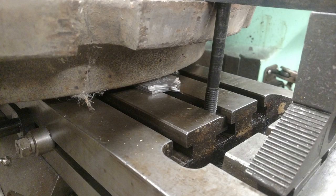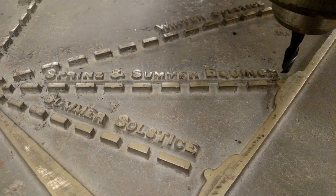To get it level in the x-axis I had to shim one side, using an indicator just like you would normally — jacked it up and threw some shims under there and kept trying until it was within a couple of thousandths. Once I had the x-axis where I wanted it I just had a couple of machinist jacks underneath the piece on the y-axis and moved those around until I got it dialed in that way as well. If I remember correctly I just indicated along those dashed lines and got the letters straight that way.